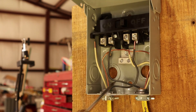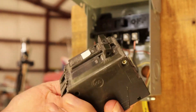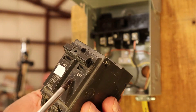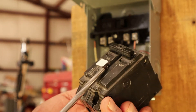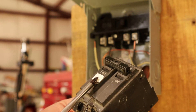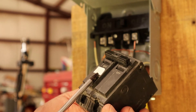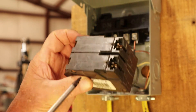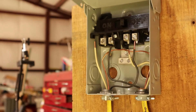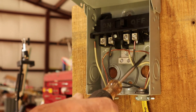Line is the power that's going to be coming from your breaker. Now this is actually a 20 amp double pole breaker, but I put a piece of tape over it so people wouldn't get confused — you're most likely going to be using a 60 amp breaker on 60 amp service. The line is the power coming in from the breaker, and the load is going to the AC itself.